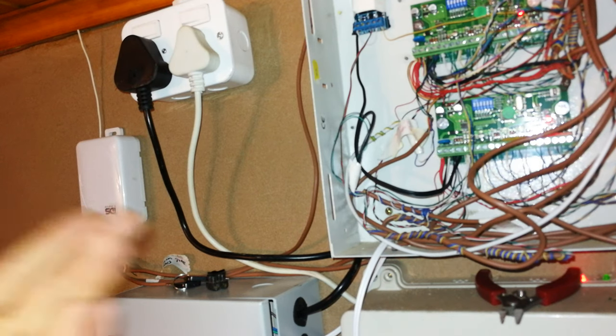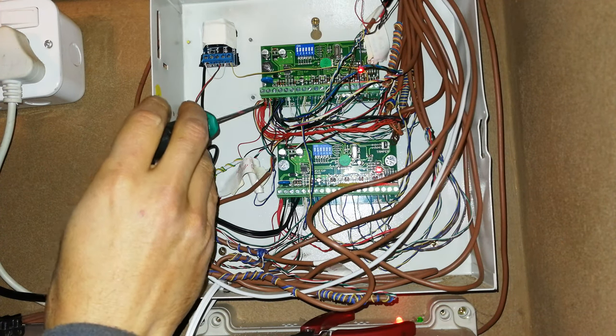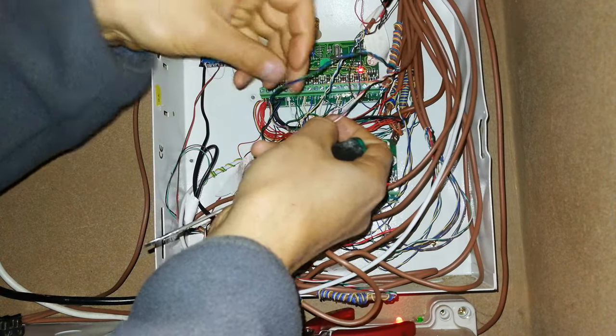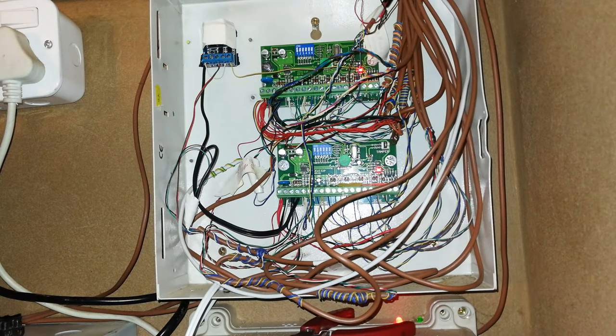So what do you do in order to make your alarm have a long backup time? The first thing you want to do is work out what your current backup time is. If I disconnect the entire positive rail, here is my power coming from my battery bank — it happens to be an 18 amp hour battery. What I'd have to do is measure the current and see what the drain is on that battery.